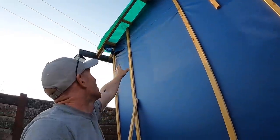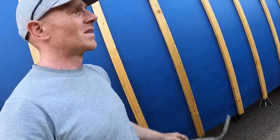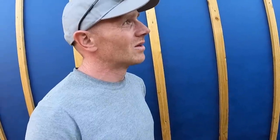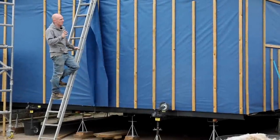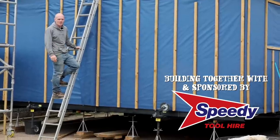Things I've skipped on and done: getting the roof ladders done. We've now got a 300 millimeter overhang — not huge but enough to match the front. We've also decided, rightly or wrongly, that rather than having a flat level soffit which is the norm, we're going to go with an angled soffit and follow the pitch of the rafters underneath. I looked at a bunch of log cabins the other day and they all seem to do it that way and it didn't look bad. We're not going to put lighting underneath there so I don't need to keep it level, plus it means we don't have to do that box-in section at the end — possibly me being lazy, but possibly the sensible way to go. Thank you everyone for watching this series and all your comments and support, especially Speedy for sponsoring the series. We're going to leave it there and get on with this roof before it starts raining — thanks for watching, remember if you can do it yourself, see you next time.